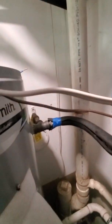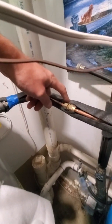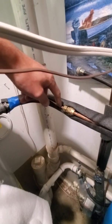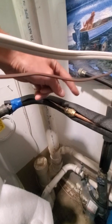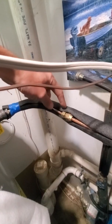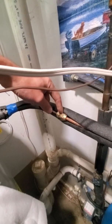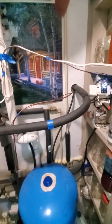This is where I went from quarter-inch to three-eighths — this is the suction line size and this is the liquid line size. The liquid line starts all the way outside, goes into the bottom of the tank, coils around 90 feet, comes out, and then I connect it to a three-eighths line using a union flare fitting, and that goes outside to the mini-split.